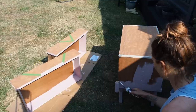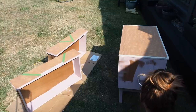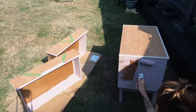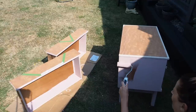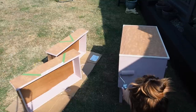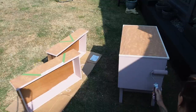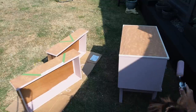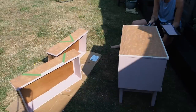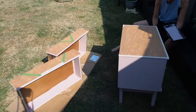Then came the fun bit — putting the paint on the sides. It's always my favourite bit to put the paint on the biggest, flattest surface using a foam roller. You do get the tiniest bubbles sometimes but you can very lightly blow on it and they'll dissipate, and I'm sanding in between coats to make sure the paint finish is super smooth. There were also a couple of damaged corners on this unit so I fillered them and sanded them down — once painted that's going to hide it completely.